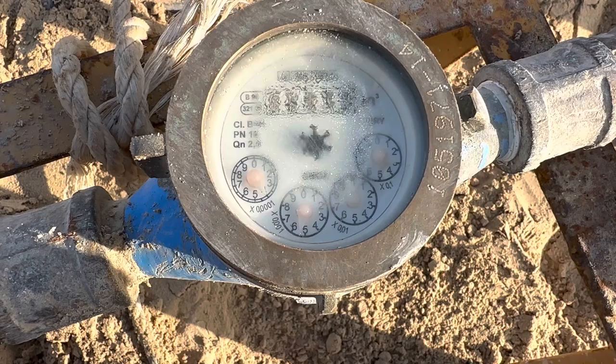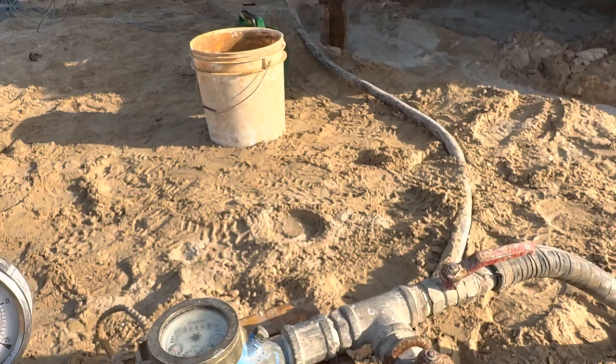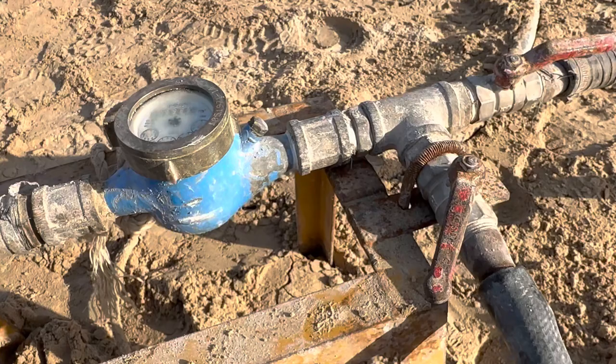We record it in a clockwise way. This is the borehole for the packer test. Once the test is completed, this valve is opened and the pressure is released from the cylinder. Then the pipes along with the packer are taken out from the borehole. I hope you understand the whole procedure. Thank you.